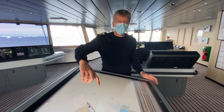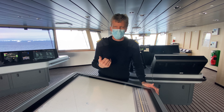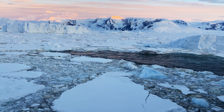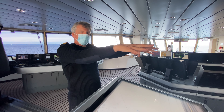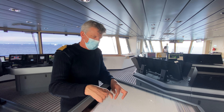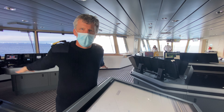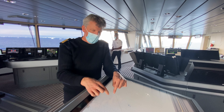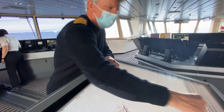But in order to turn the ship around you need some open water, because in that dense ice you cannot just turn the ship around. Our pods allow us to do so. What I did when the ship was in — I left half of the hull stick out. Then I turned the pods around constantly washing, basically directing the wash around the ship, until I had an opening big enough to move into. Then I started to angle it in that open basin, flushing the ice again until I could turn it more. It took about 30 minutes and then the ship was turned 180 degrees, and I could head straight back out.